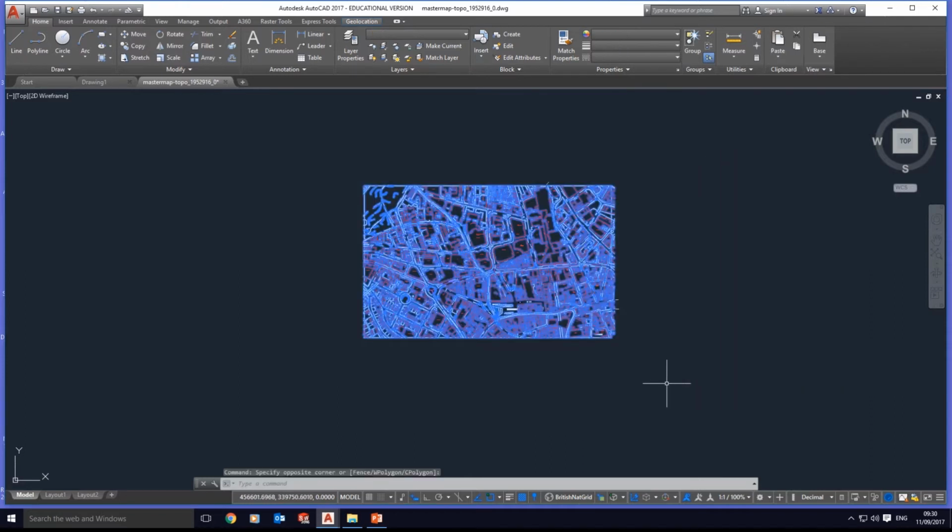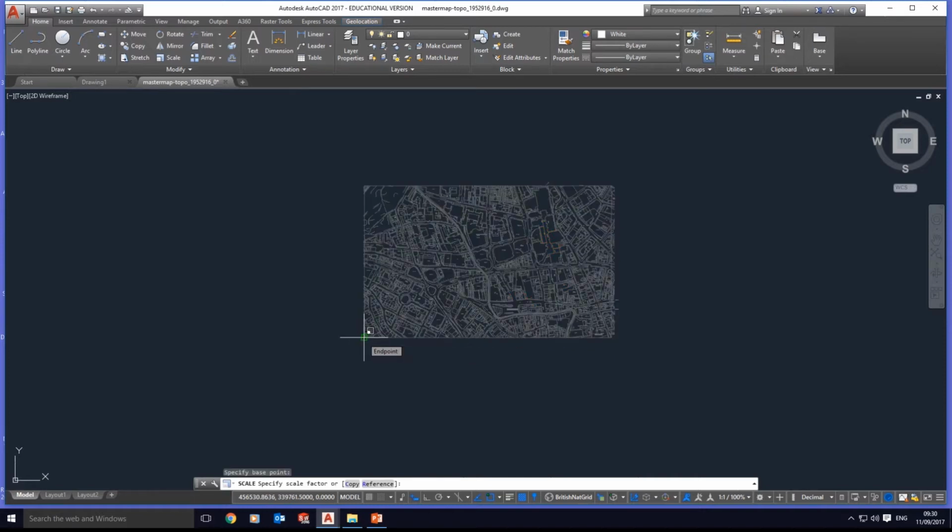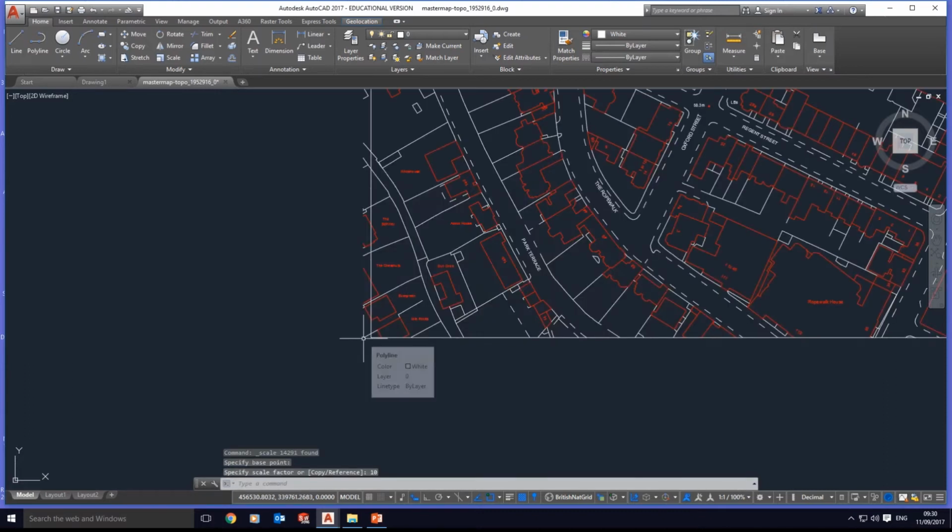If you want to use, for instance, the small board that we already have prepared at the workshop, which is 800 by 400, we can decide to scale it up to fit it on the small board, and scale it 10 times. Select all, then click on the scale button, click on one base point, and then enter the scale factor. This time it's not a fraction or decimal, it's 10 times the number that you want. Then only enter 10 and enter.